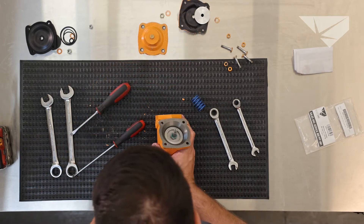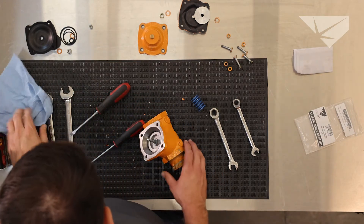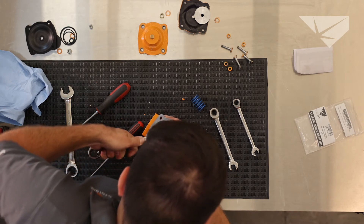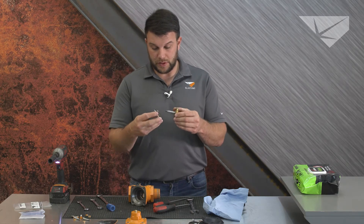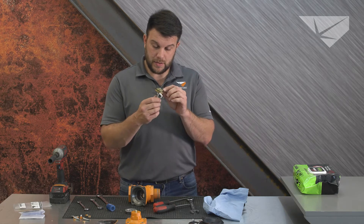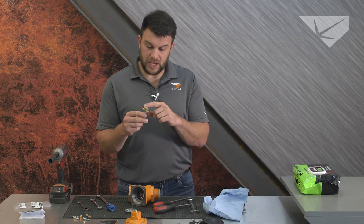So once you get to this point, we're going to get a wrench and we are going to walk out the center assembly of the valve. You want to be very careful with this one as well — if you strip out this nut, then you're buying a brand new valve. So once you pull out this assembly, you're going to notice that you have the top cap with a center o-ring and what the plunger looks like. If you have blow-by on an auto air valve, you'll notice that the seat here on the base has a big gouge in it and you'll lose air through there.